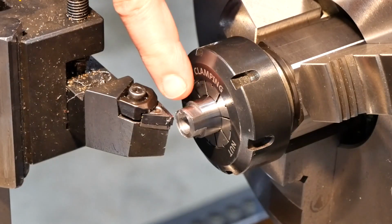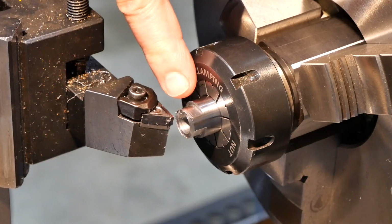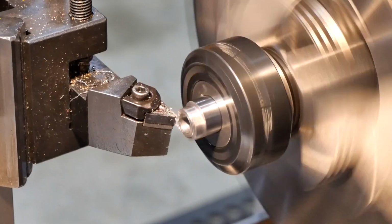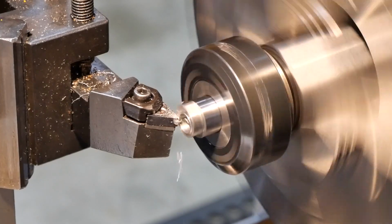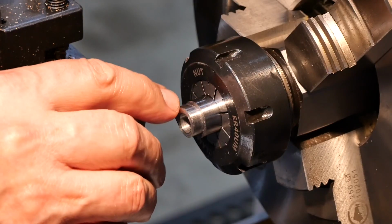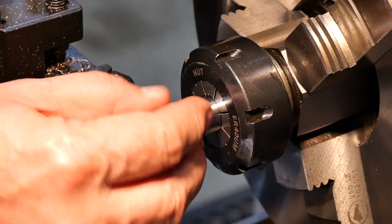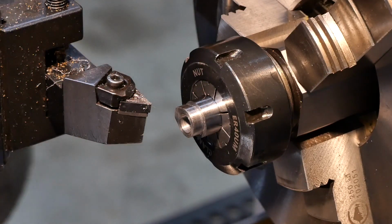Okay, obviously back in the lathe, so I'm going to clean the face up and take that millimetre off that was marginally undersized. I think that's enough. I've just got a burr there to clean off. I will finish that off by hand, I expect. But that looks alright. I will get the parting blade set up.